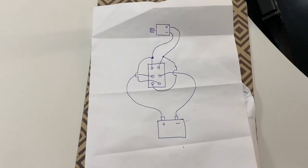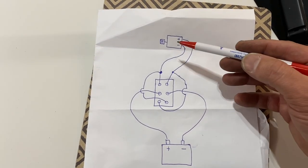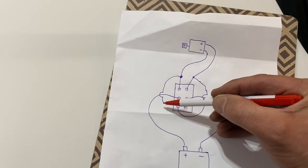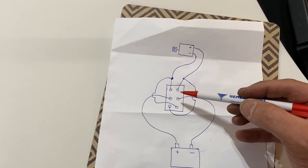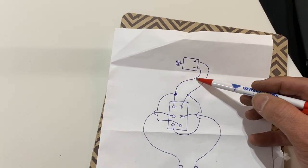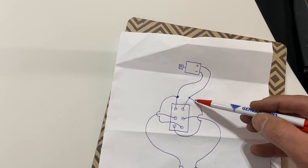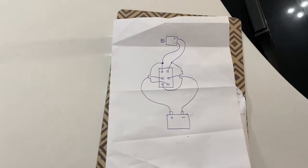Here's a diagram of a six-prong polarity-reversing switch. You have your battery and your motor. Power goes into the switch — the wires cross over and don't connect to each other in the middle. When you click your switch one way, polarity goes out in one direction; click it the other way and it reverses — so one direction goes into the motor and the other reverses it. A four-wire switch just has that same internal setup with only four wires coming out.